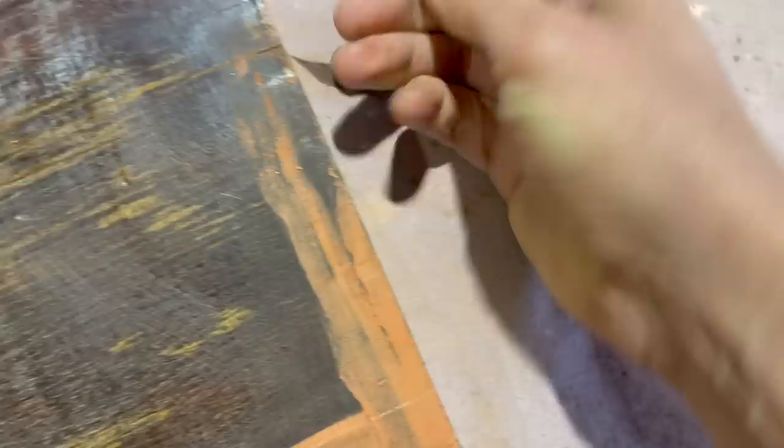I think he was trying to deal with missing finish. Maybe he was thinking of painting this and just doing a cleanup that way, which if that's all he's doing, then I don't care. It's not going to be a big deal. We're going to be stripping this finish off anyways, so that's good. What I don't want is putty under veneer, where I have to re-glue veneer and then there's putty everywhere. But we've got lifting veneer here, and I just don't want putty under.